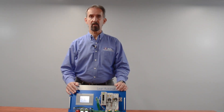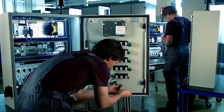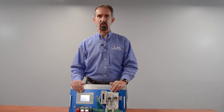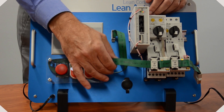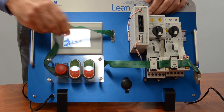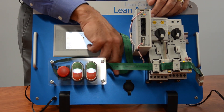With the use of a single 8-conductor cable, instead of wiring components individually to I/O points, modules can be connected and linked to the central controller via a gateway module, or directly to an Eaton PLC. This eliminates labor time and point-to-point wiring, in addition to saving hardware and panel space.